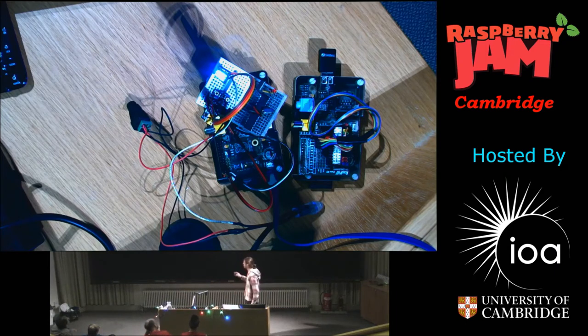The Arduino is a very nice way to handle analog I/O because it's one single piece of kit. You can pick up a kit of parts to produce a little breadboarded microprocessor for around £5. Compare that to buying a separate analog signal converter and various other input/output devices, or even any of the prototyping shields for the Pi. The Arduino is completely self-contained and completely autonomous. You can take it away from the Pi and whatever you've programmed it to do, it will continue to do — it doesn't need the Pi. Compare that to pretty much any other add-on board. Although an Arduino ranges from £5 for a basic kit up to £40–£50 for a full-featured one, it's quite cost-competitive because it does all this extra stuff.